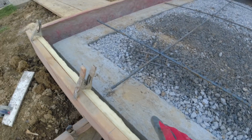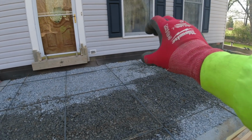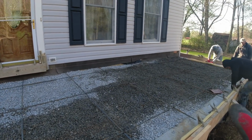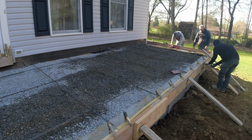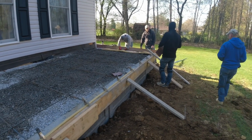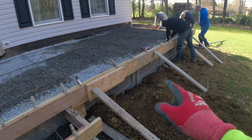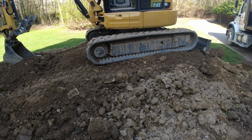Broken stone liner. Our sill also has the broken stone liner. We pulled that siding off. We put waterproofing ice and water shield against that wood, and then I'll put the siding back on when we're all done with the concrete. They're just taking care of some gaps over there, so concrete doesn't go down between the step liner and the face. We don't want to really see it running down our nice new wall there. So I'm going to go ahead and get this dirt loaded up. Mixer is due any minute.